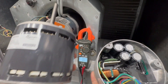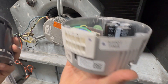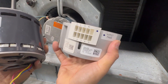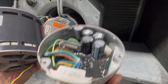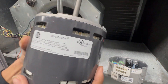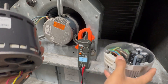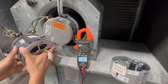What's inside an ECM? There are essentially two parts: the actual motor with the shaft, and the brains — the base that goes on the bottom. It's pretty cool — you're feeding it single-phase power and it converts it to three-phase. So this is actually a three-phase motor internally.